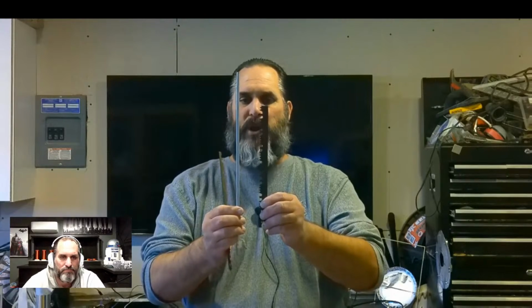One of my favorite things to do with plasma is to connect it with these items here. Now this is just a solid piece of aluminum all the way through. These right here are just saw blades. They were once one blade, pretty big, used for cutting tree limbs and stuff. Anyway, what you do is you connect the positive here or the negative, it doesn't really matter. So just hook the one you think is positive here, the one you think is negative here. Right about here, you're about 1.5 inches off. That's about exactly where you need to be. Sometimes a little more, sometimes a little less, but that's where you need to be. And that'll create that nice plasma bridge you see right in between it.